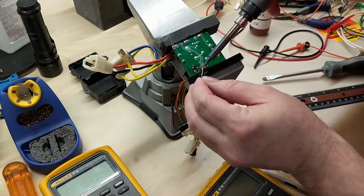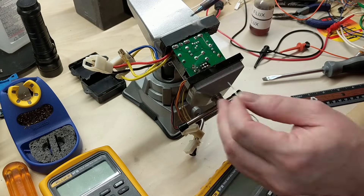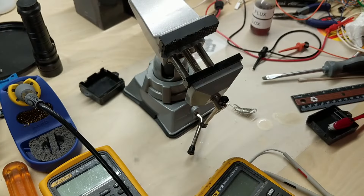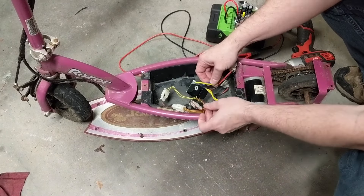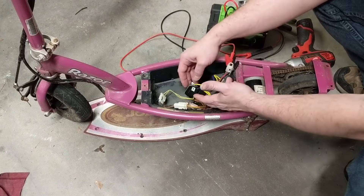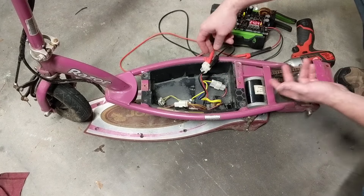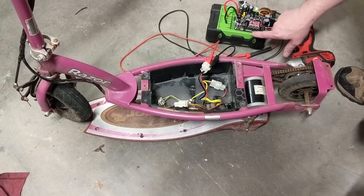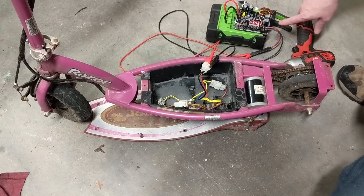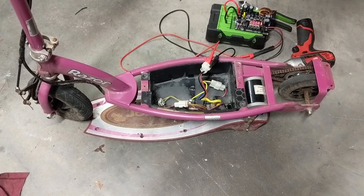The board does have a little bit of a coating on there as well. Back now with the board corrosion cleaned up and the bad solder joints re-soldered. I want to retest before putting it back together. I have a 24-volt supply coming off the battery terminals, with a current set point of about 2.3 amps to give a good bit of current to start. The output is 24 volts — showing our current — and we can hear the relay click in as before.